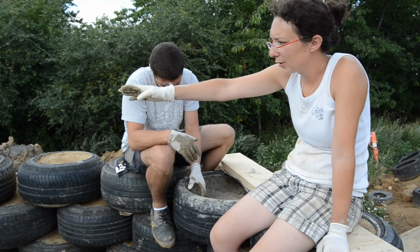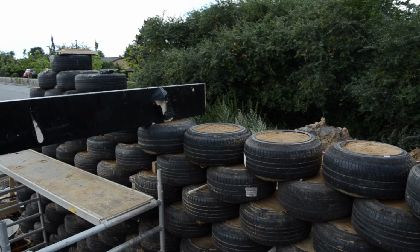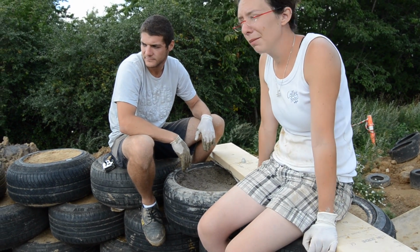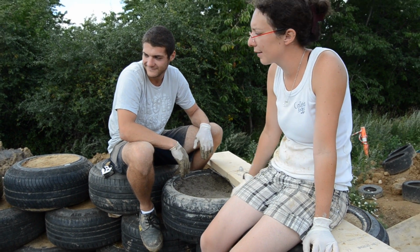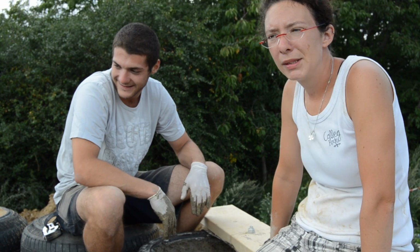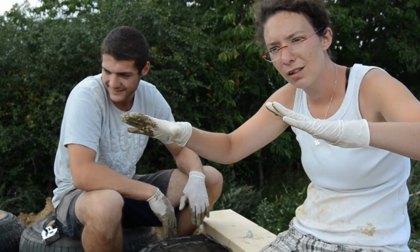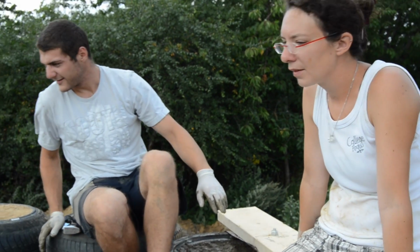So right now our plan for this wall that is really wobbly is to fill up all the gaps with the same plaster, cement and quicklime, and we'll see if that solves part of our problem. If not, we're going to buy some more geogrid that we have behind to make sure that there is no earth pressure against the wall. And then again, with the bolts and all the beams, it's going to add like a diaphragm for the entire structure. I'm not too concerned.